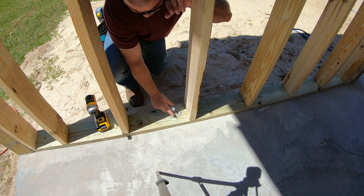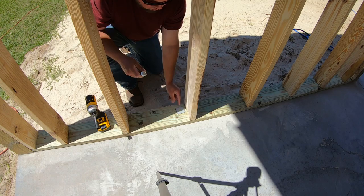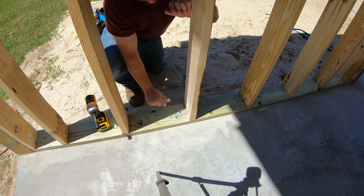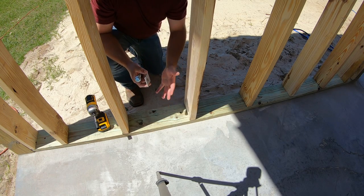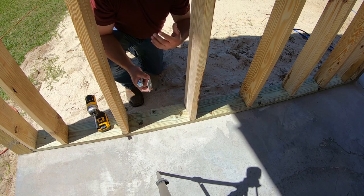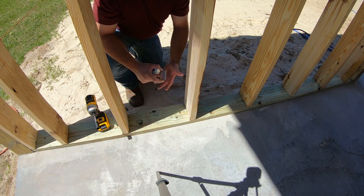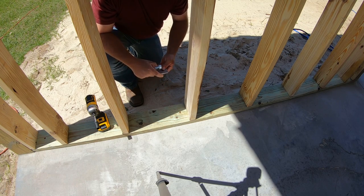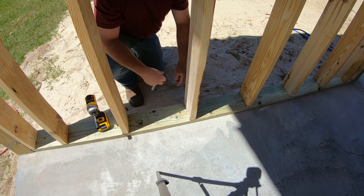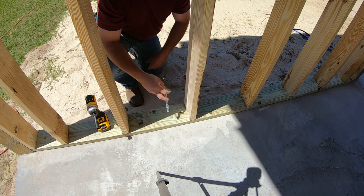The anchor goes down and bites into the concrete. This is called a plate washer — they come in two-inch, three-inch, and different thicknesses. It spreads the load over the board instead of just that tiny bolt lip. This wall isn't directly attached to the roof, so I'm not too concerned about uplift, but because we are attaching this to the post there's a slight potential for pull-out. This is cheap insurance — a few hundred extra dollars throughout the building for really good anchoring is well worth the peace of mind.